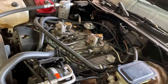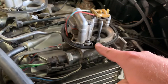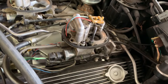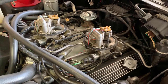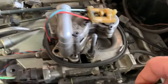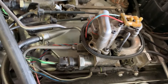Before you start, there are channels right here where your idle air control stepper motors get their air from. Those need to be bypassed before you even start or it's not gonna work. They did a long time ago make a tool that slips down in there — I can't remember the brand name, I want to say it was Lyle. They made a specialty tool for these, since these are basically two 2.5-liter four-cylinder throttle bodies. But that tool is long gone, long discontinued. Anyway, I use tape. Stupid as it sounds, I just take a piece of Gorilla tape, cut it to fit the channel itself, stick it down in there, press it against the port with a screwdriver. It seals perfectly. Never had a problem doing it — I've been doing it like this for 20 years.